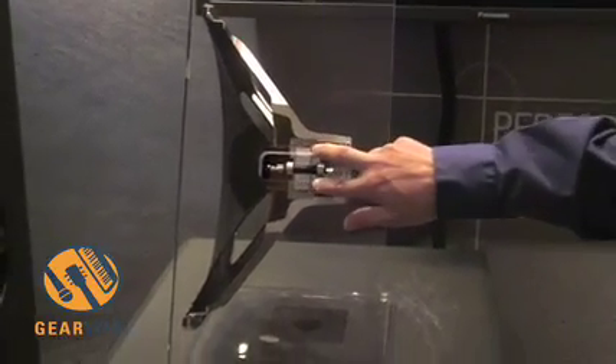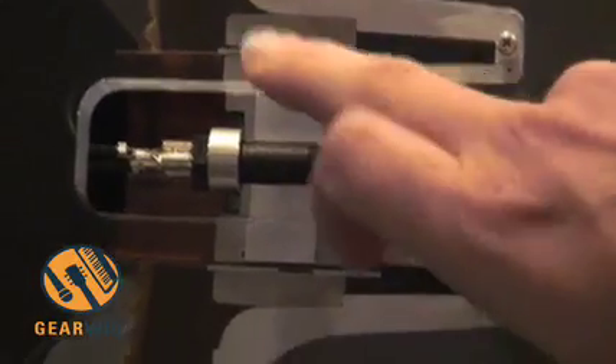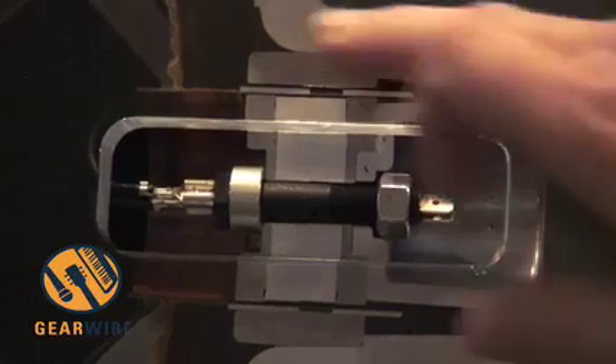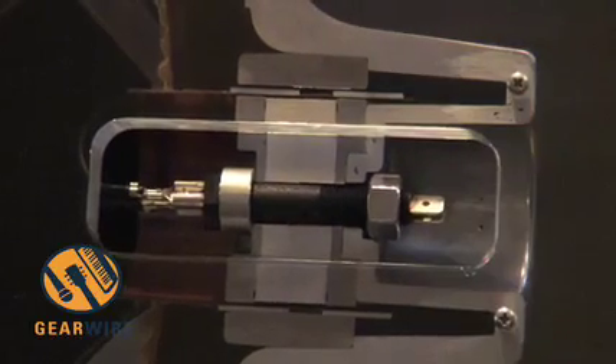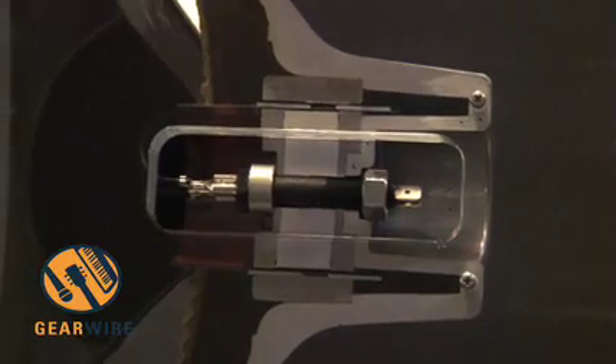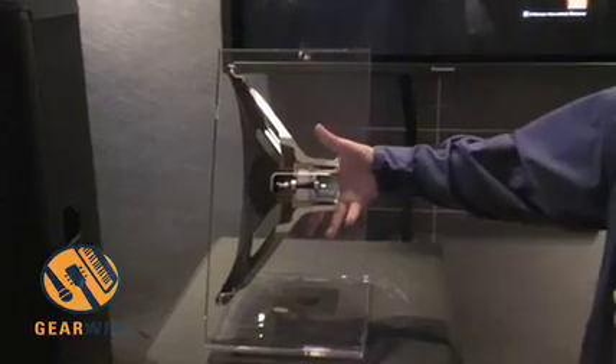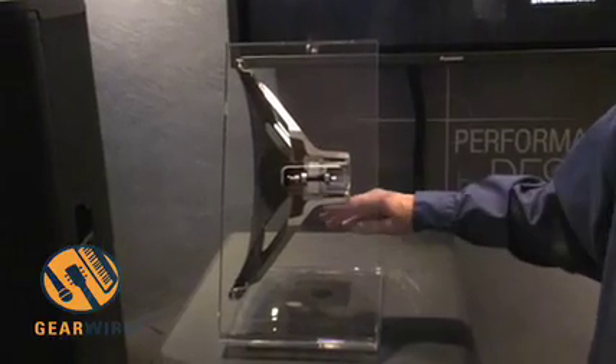That's a little neodymium, but high performance magnetic material. We use two different voice coils — one there and one there — to have two voice coil gaps, so we get a lot of metal within that magnetic field. We don't actually lose any performance; we enhance the performance. But as you can see, we drastically reduce the size and the weight.